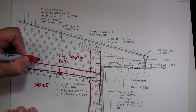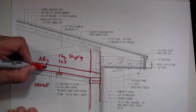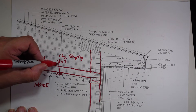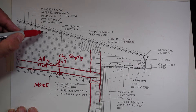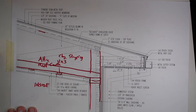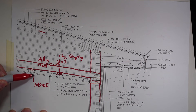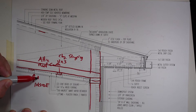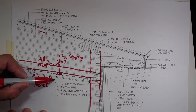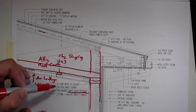The important thing is that here we're inside the house, and here is basically our attic or roof cavity. I say attic because as you go up the roof here, it isn't tight to the vent anymore — we actually have about 30 to 36 inches on the first third of the high part where we have some attic space above the insulation. What we want to do is control our air leakage.